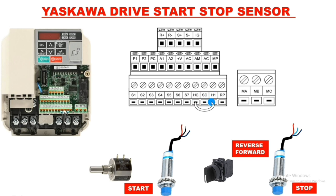In this video we will do wiring with SC. For potentiometer connection we have terminal A1 — A1 is for analog input voltage type. Since a potentiometer references voltage type, A1 is used for potentiometer reference. If you have a transducer, use terminal A2 for analog input voltage or current type. For potentiometer positive supply we use the plus V terminal for 10 volt DC, and for potentiometer 0 volt we connect to AC analog common which is 0 volt.